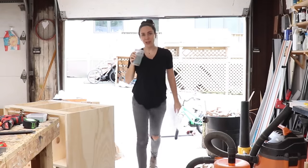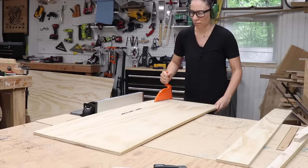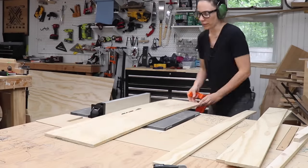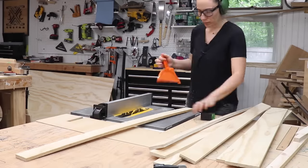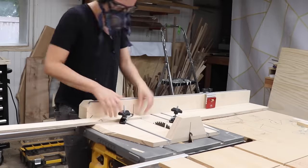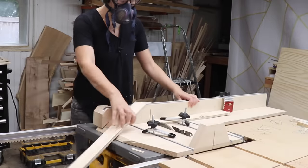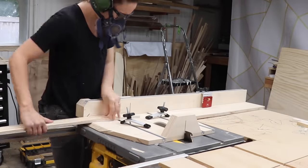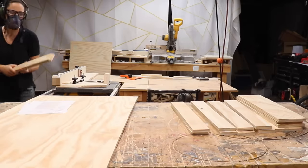Let's build some drawers. To keep the cost of this build down I'm using half inch plywood for the drawers. I start by ripping all the drawer parts to width at the table saw — it really helps to have a good plan with a cut list here to minimize waste. Then using a stop block on my cross cut sled I cut all of the drawer sides to length. I trim off one end of the piece then butt that squared-up end against the stop block and continue down the line.